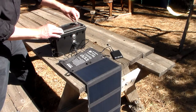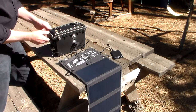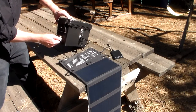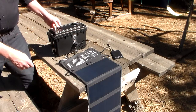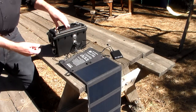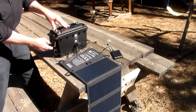What I have is two spare batteries. Now, these are too close together for normal operation. These are the antenna connectors, but just for showing you how this works — there's also an antenna connector down here and this one has a duplexer on it, so you can use it for cross-band: two meters and 70 centimeters in or out. One is going to be receive and the other is going to be transmit, and that way you can use a copper J-pole or something up on a pole and you won't have a problem.